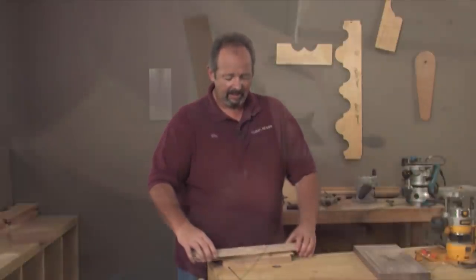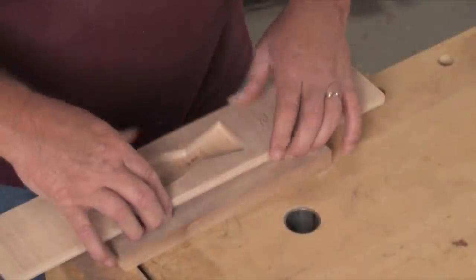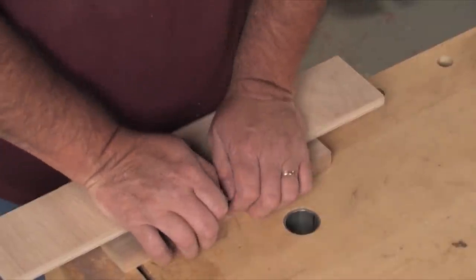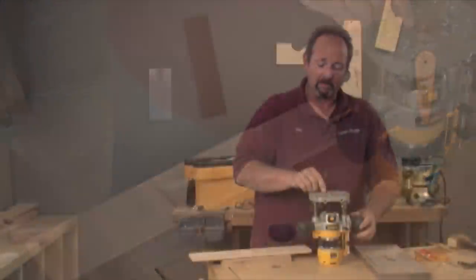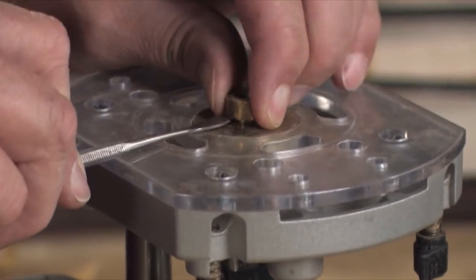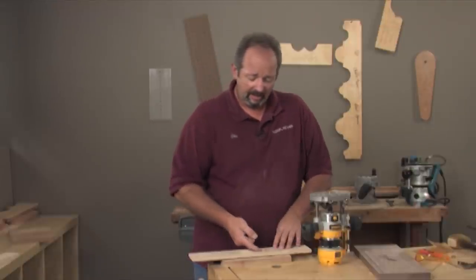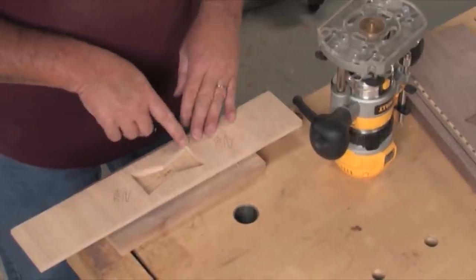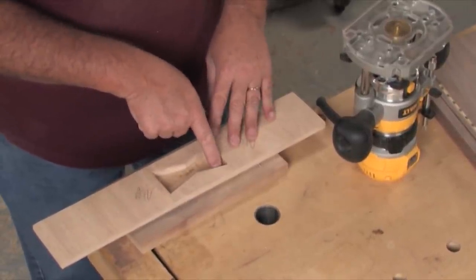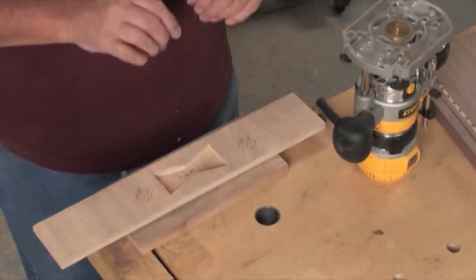If you look down through the top of this, I can move it to come up with whatever grain pattern I want. The piece I'm inlaying has very straight grain, so I'll just pop it down for straight grain and make sure it's secured well. Remember, for this next step we have to pull the bushing off. This routing step is a little more precise — you have to start tight against your pattern and stay against it all the way through. The four corners are easy to stay against, but where it changes direction, it's real easy to slip off into your pattern. So go slow and make sure you stay tight to the pattern.